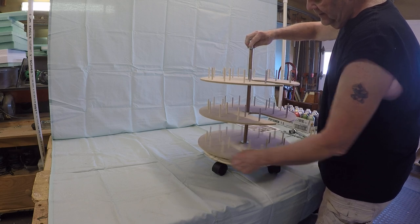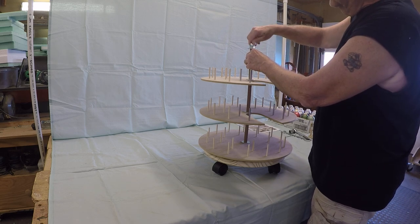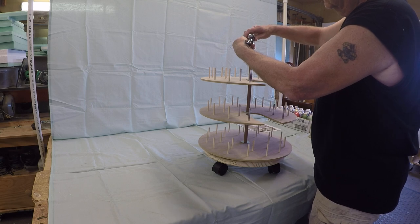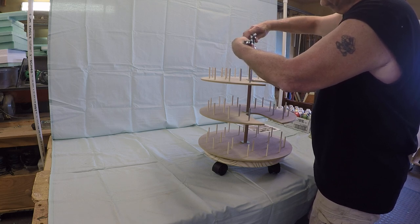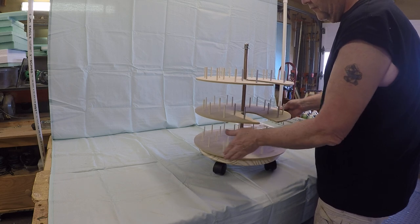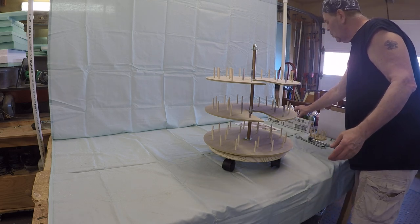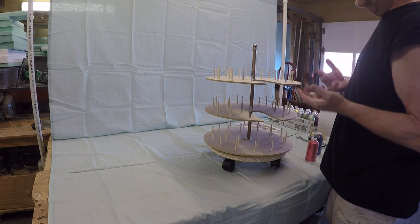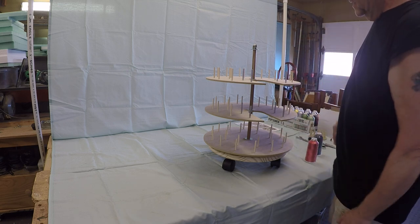You can adjust the tightness — either really loose or firm depending on your preference. Grab your acorn nut that goes on top. Place your three-quarter inch wrench on the bottom nut, then with your ratchet or other wrench on the top nut, keep the bottom one stationary and tighten the top nut down. That will lock the two nuts together while still allowing you to rotate your shelves. You'll also notice the shelves have four steel pins in the front — these are simply to counterbalance the missing area cut out for the slot and help keep it on balance.